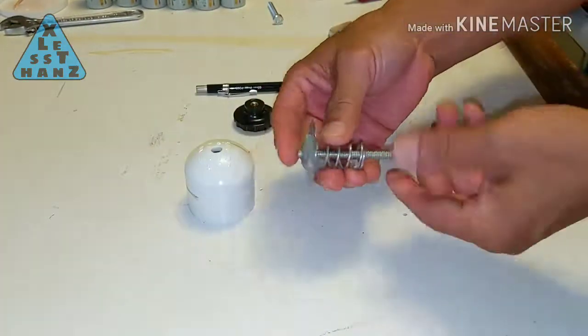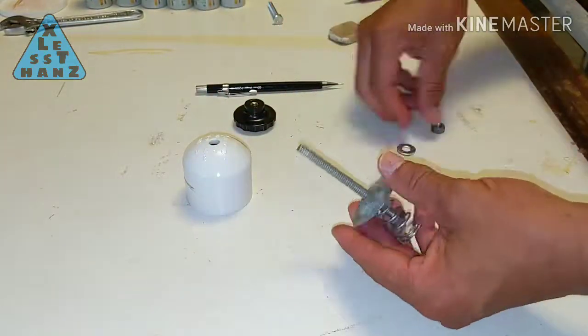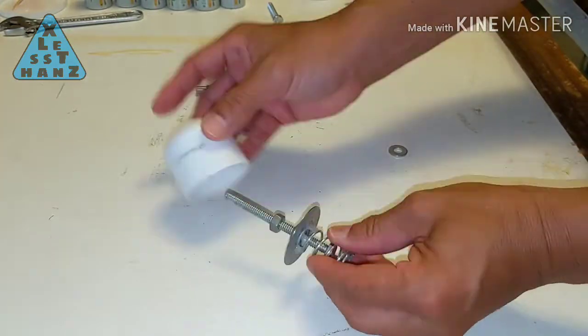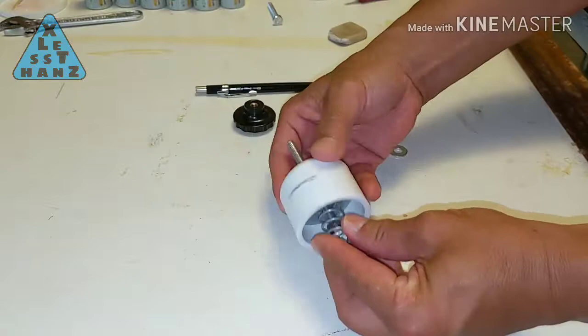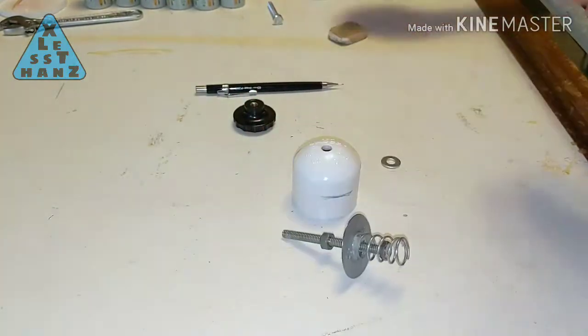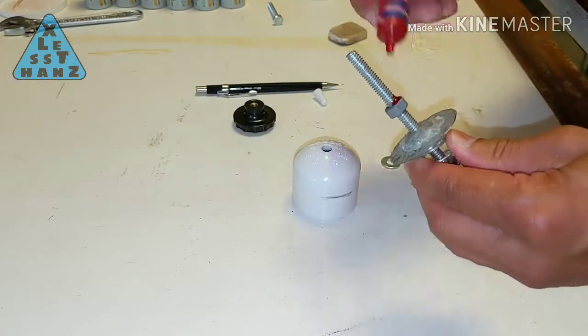Screw the circle end nut onto the bolt, leaving about 3/4 inch between them. Insert the bolt into the cap, and with the nut bottomed out in the cap, tighten or loosen the nut until the circle is roughly in line with the line drawn outside the cap. When you've got it about right, Loctite it in place and let dry for a few hours.